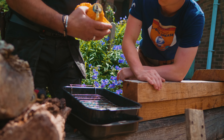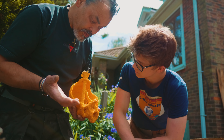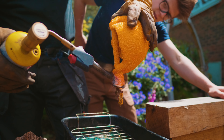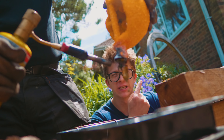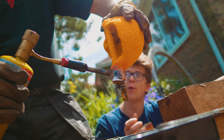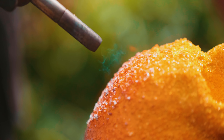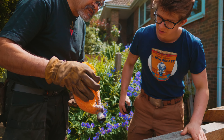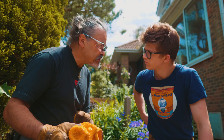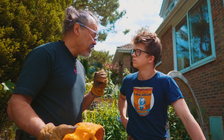This is the burnout. So what we've got here is our wax skull with all the pouring cups and everything. You can see it's designed to get all the bronze into the parts that we want. But it's full of wax, so what we do is heat up the wax to get it out. It just melts straight away, dribbling out. It's really focusing on getting the outside perimeter of the wax out of there, making sure that as it's melting later on when you put it in the charcoal, it's just blowing right out instead of cracking. So there's still quite a lot of wax in it and we need to get that out. But it should be at the stage now where it won't crack. So we can put that in the furnace and burn it out — there should be no trace of wax in there. If there's a trace of wax and we pour our molten bronze in, it will explode.